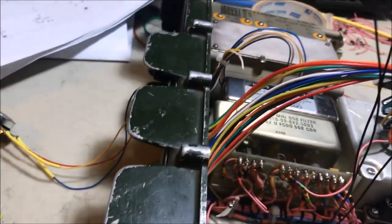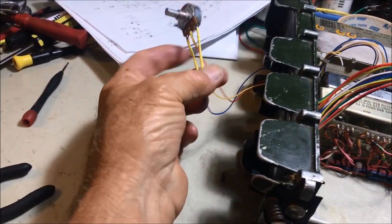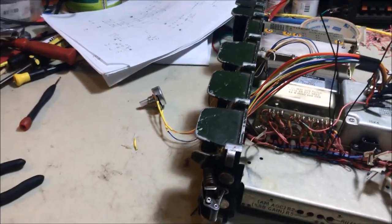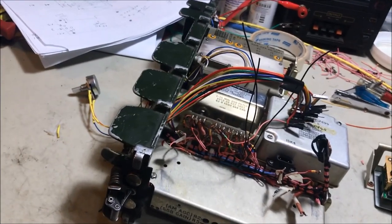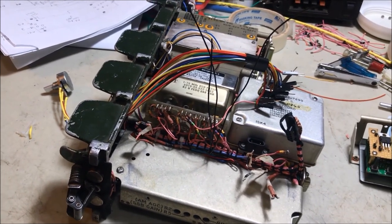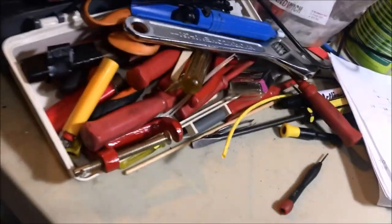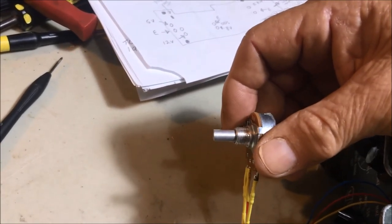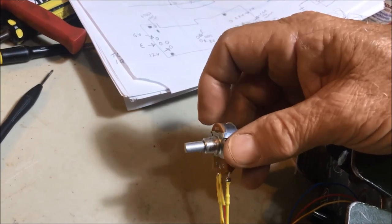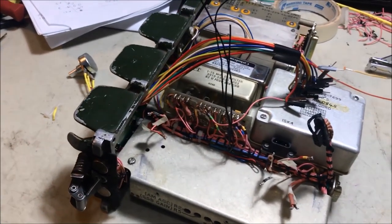As far as the resistor for the tuning of the receive, look, I've put this particular one on here just as a temporary measure while I'm doing the testing, because what I want to do is fit a variable resistor on the front that'll fit the original frequency selection knobs, so it looks like it's part of the set, but it'll in fact be our front end tuning. And these particular resistors, they're really easy to get, but of course the shaft size is way too big. I think they're 6mm shafts, and you have to actually drill the front face of the radio out to fit the threaded section through, and that's really not appealing. That was one of the things that I thought on my prototype that I would do better this time.